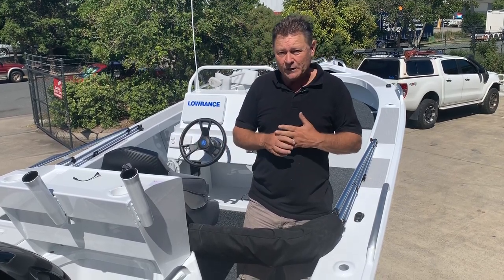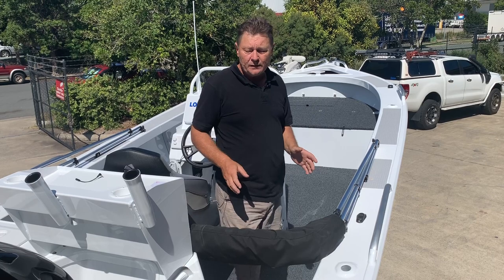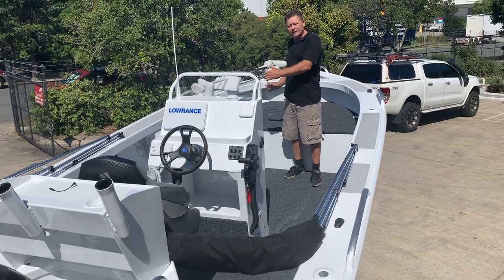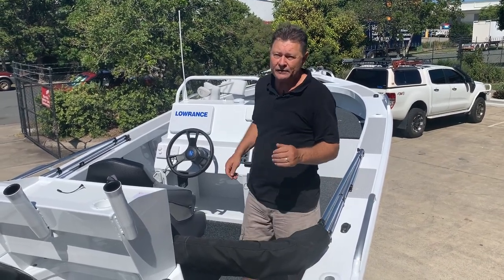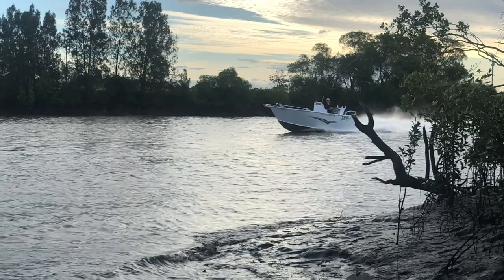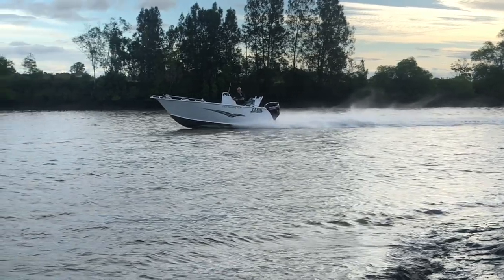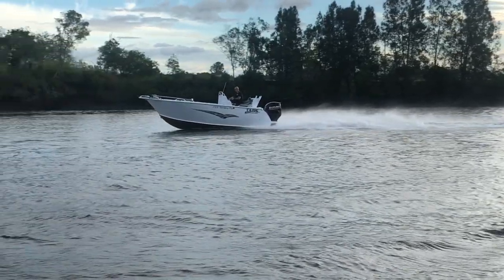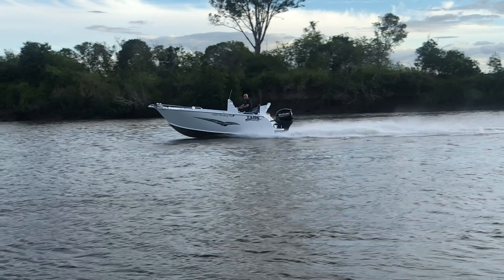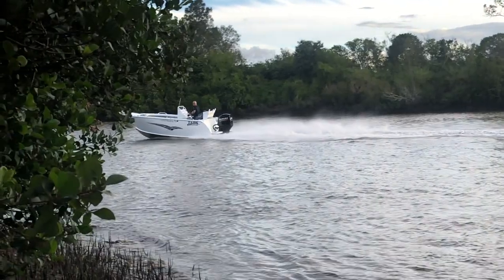What I really wanted to get into here was the layout of the boat. With a rear mount, we've shifted the console from the front to the rear of the boat for maximum ride and comfort and full trim range. You're going to see about a foot of boat in the water, which gives you dryness, range, fuel economy, and top-end speeds — things you can't get with a nose-down attitude. When shopping for a boat, look at videos on the water and see where the water's exiting the hull. If it's at the rear, you've got a great boat. If it's pouring off the nose with the engine trimmed out, it's a wet boat and there's nothing you as a driver can do about that.